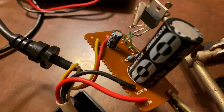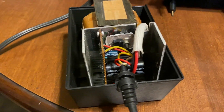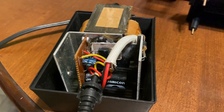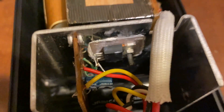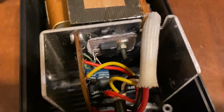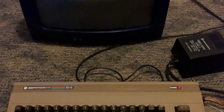Here's what mine looks like attached. Make sure the wires will not touch in any way, especially if you push the regulator down toward the PCB a bit — you'll need to do this to reinstall it. You'll want to get a little thermal paste to put on the back of the LM1084, and then reattach it using the screw and nut from the original NTE 1934 and tightly secure it to the metal heatsink enclosure, being careful not to allow the pins or wires attaching it to the PCB to touch. Before you fully reassemble, test the voltage between pins 5 and 2 on the power plug of the power supply to verify the voltage is now in tolerance.